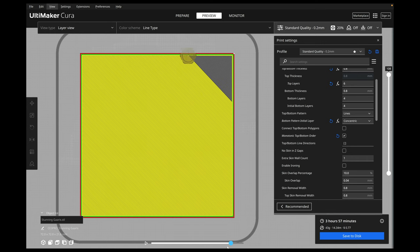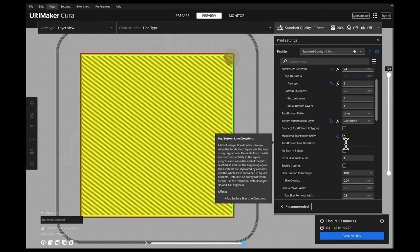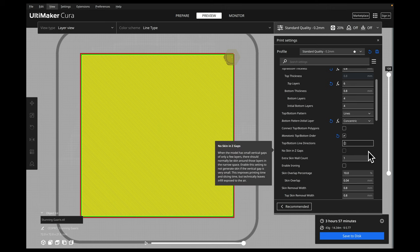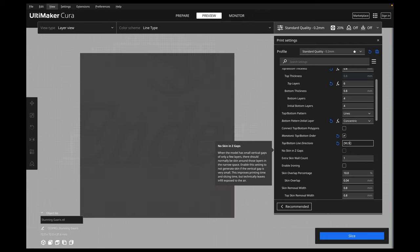The next setting is top and bottom line directions — the angles at which we want to print our top and bottom layers. Typically it prints at a 45 degree angle, because it's fastest when both X and Y motors are enabled. When going at an angle, your bed is moving for the Y and your X is moving across, so both motors are enabled and it travels more. But if you want a consistent look on your top and bottom layers, this is where we can change things. We'll see here it is printing at a 45 degree angle. Now going to our top and bottom line directions, you'll see a bracket — we need to leave this bracket and type our numbers in there.